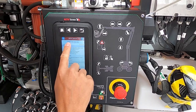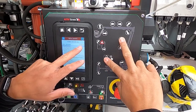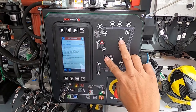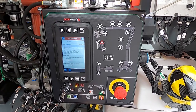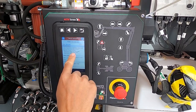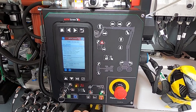On the next page: YV420U arm raised valve — real time. We're going to give you the real time value going to that component. So if I activate arm raise, notice there's no power coming out to it — something is not consuming that power, we're not getting that signal. It says here: if arm raise function is requested, output must be on. If not, we go through the steps to check why it's not working. So we check the power supply fuse — fuse 13, 20 amp — check the power supply battery voltage on wire 103, and then check output wire continuity. We're not just telling you what's wrong; we're telling you where to go look to remedy the problem.